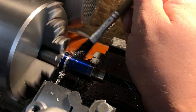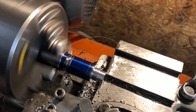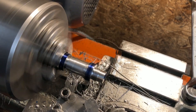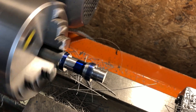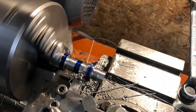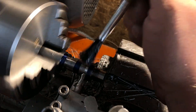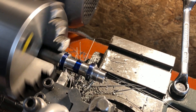I'm setting the length with the parting tool, a tenth or so oversize to allow cleanup, and the diameter is then taken to size turning close to the layout line on the right hand side of the cut. With that done I can switch to a form tool, and I'm feeding this by hand to form the radius up to that line. A handful of chamfers, and I can move on to the internal work.